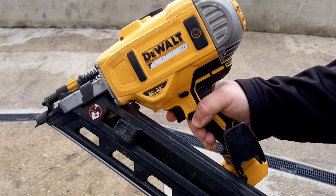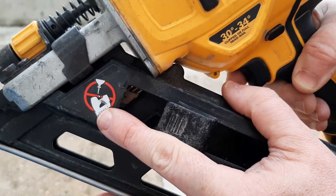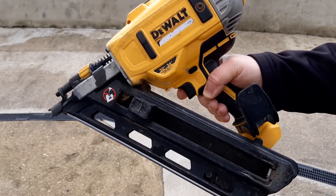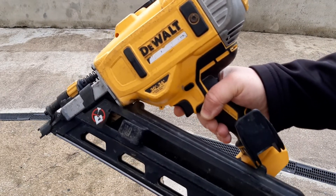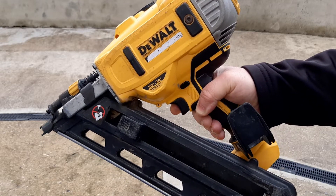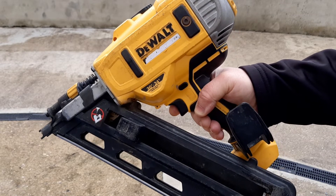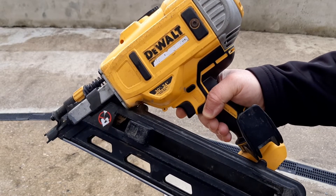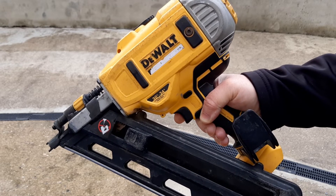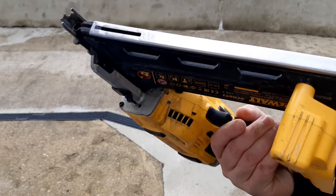Usually that'd be a good idea, but not in these nailers. If you look at this symbol: do not oil. These nailers — most of these DEWALT nailers, everyone that I've seen of this series, different types — are all built to run dry. And if you do oil them, it messes them up and you can end up having to pay to get them cleaned up again, or having a messy clean-up job yourself.